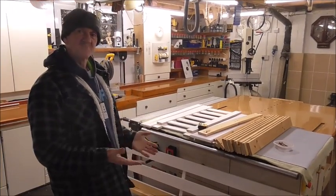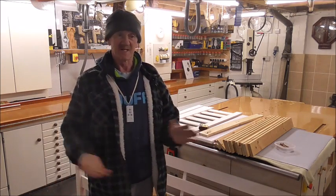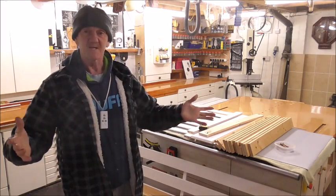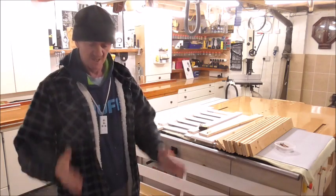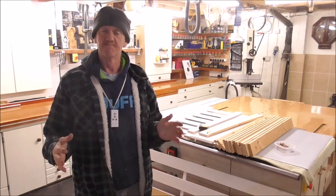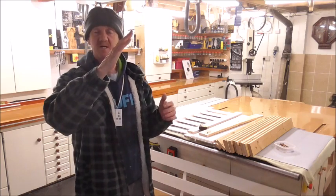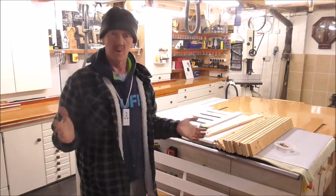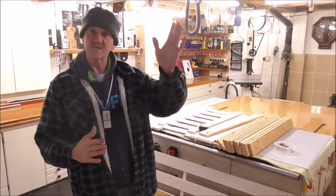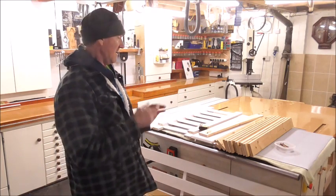The other piece that we'll need for this project, of course, is a ladder. Now I'm going to do a ladder the same as I always do, something like 100 by 20 length, 2 of them, and then some 28-30mm dowels running across, just 300mm. That's more than enough. This boy's still on the young side, 3.5, 4 years old, so I don't want something dead vertical. I don't want to use his strength to get up. I want to put a bit of a pitch on it, and then maybe later on they can put it vertical if they want, but I'm going to make it in such dimensions that it's set initially at an angle so that he's got a little bit of a pitch to climb up, make it a bit easier for himself. That bit I've got to do as well.